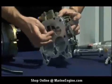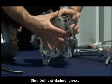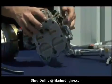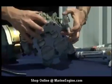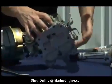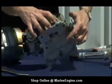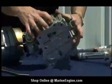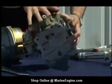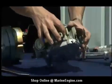Finally, if you were to take these throttle shafts out on this marine carburetor, you'd find they're actually grooved. As time goes on and these throttle shafts wear, in an automobile application fuel will puddle along these shafts and onto the intake manifold. This grooving on the marine throttle shafts keeps that fuel working its way back into the throttle blades and keeps the fuel contained within the marine engine.